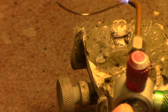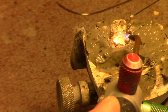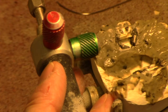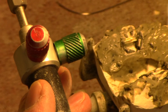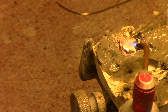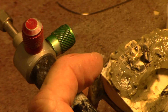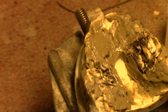I've got another clean probe with a little bit of solder on it. I'm going to use it to paint the solder around and get it molten again. The probe gets very hot and solder follows heat. See how it's oxidized — without that little dollop of solder on the end that would have contaminated the solder area. I'll reflux a little bit. Soldering is really a two-step process: first is the sweating, second is adding the bulk. If you get the solder just at the right temperature where it just barely melts, it will polish beautifully with no porosity. Too hot and you'll get porosity; contaminants can combust or vaporize and also cause porosity.